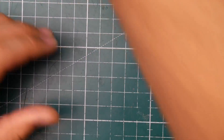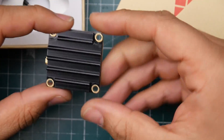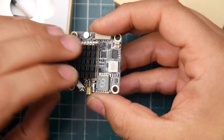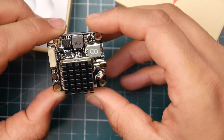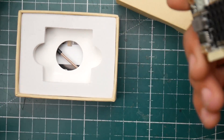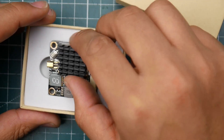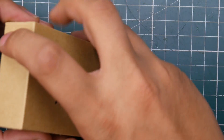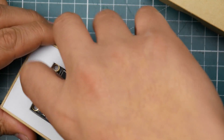Here's the AKK VTX that broadcasts 2 watts — this is a beast. It has two heat sinks, one on each side. If you're adding a fan I'd recommend this side, though the other side is okay too. I'm planning a 3D-printed mod to hold a fan and keep it cooled if I run the full 2 watts. Some people won't be able to get this one, but I'll have it linked below — if you're in the US, get it from Banggood since AKK won't ship it directly.